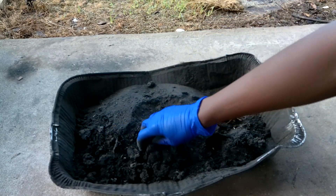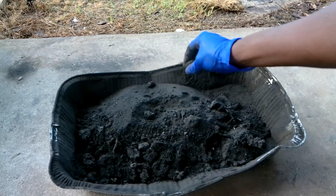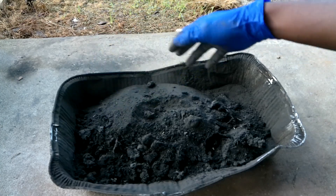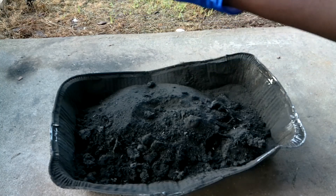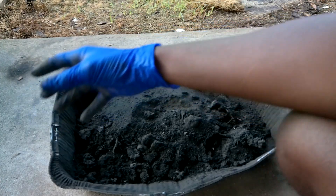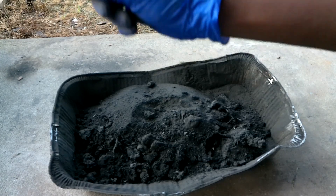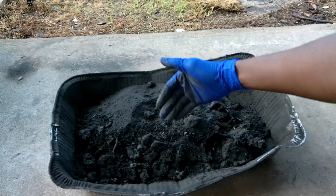Just look at how dusty it is — I just touch it and dust flies. So it seems like moving the carbon to the end of the chamber near the end of the run really helped. I think that's because the reactor gets up to about 800 degrees Fahrenheit, 430 degrees Celsius external body temperature, meaning the internal temperature of the actual plastic and carbon is probably at least a thousand degrees. When we move it towards the end, that heat all goes to the end of the reactor. In past runs there have been some oils or unfinished carbon at the very edge, because most of the heat was stuck in the back. Moving it near the end of the reaction seems to be the most advantageous thing to do.